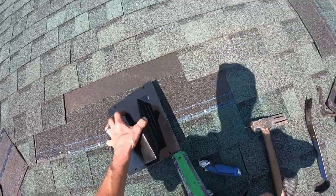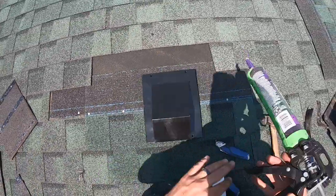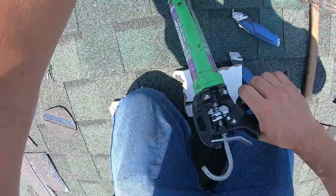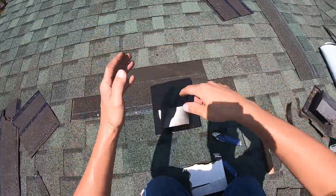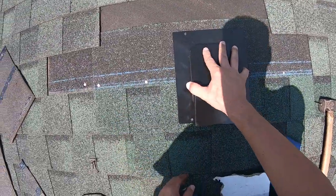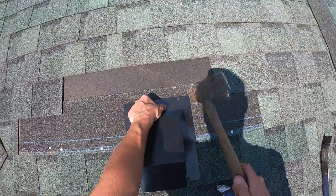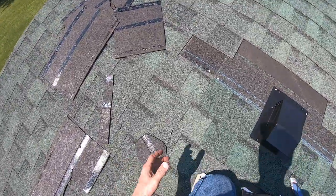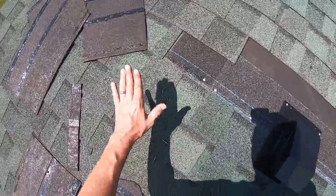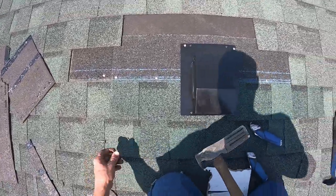Even my caulking gun is on fire now. On days like this, you want to wrap up early or you could scuff the roof. Scuffing is when, on a hot summer day on a steep roof, just the weight of your boot standing on the shingle will rip the granules out, especially on the edges — and that can do real damage to the shingle.